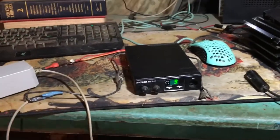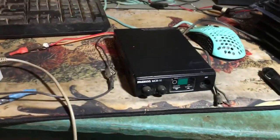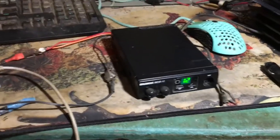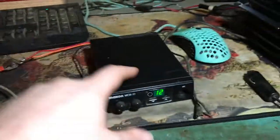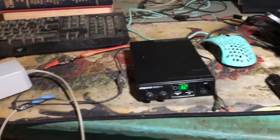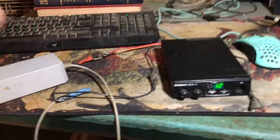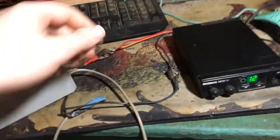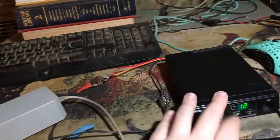So when you turn your radio off, so let's go to an arbitrary channel, 12. All right. So the power's off, but you come in, you turn it back on, and you're on 12 again. So basically what's happening is the black wire is your common ground, and the orange wire is keeping the memory in your radio on a specific channel. Which is incredibly important. I mean, God, you save so much time, right? Anyways, the point being is they were supposed to be hooked up to a source that was always on. So that the little red wire would be hooked up to your switch or whatever, so that that would completely go off when you turned it off. So the radio would not be on.